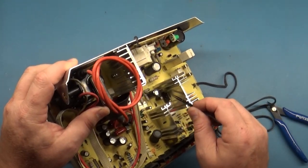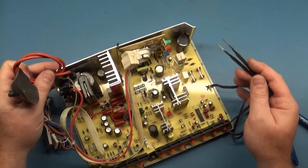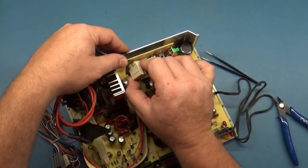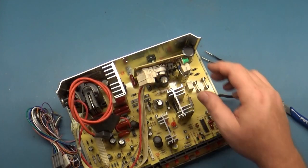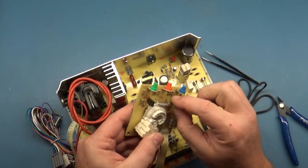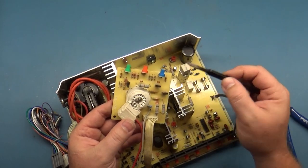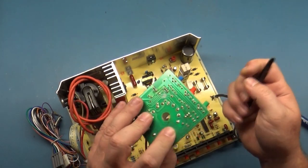Here is your vertical IC on that heat sink. The HOT is right here on this heat sink. The neck board — they have it here with this twist tie. Let's get this off. It is absolutely basic: you've got your neck socket, three resistors for your color — red, green, blue — your pots, your transistors. Just the bare bones basic necessity to make this actually run.